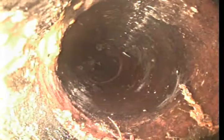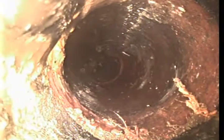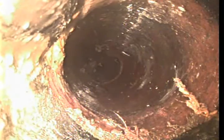You can see more root growth in the tile pipe, and then right here, unfortunately, we switched from clay tile to what's called Orangeburg, 4-inch Orangeburg pipe. Orangeburg was put in between World War I and World War II to save up on metals. This type of pipe is basically made up of wood pulp and compressed tar paper in layers.